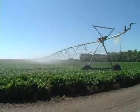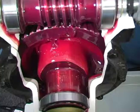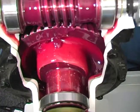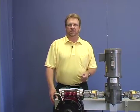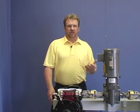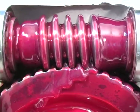We made Sprinkler Lube thixotropic. Many have asked us, what does thixotropy mean? Thixotropy is the ability of a lubricant to thin down with movement and then thicken back up when it sets again. So most lubricants thin down by temperature. Sprinkler Lube is designed to thin down by movement. We hadn't heard anything like that before.